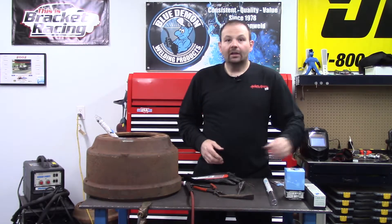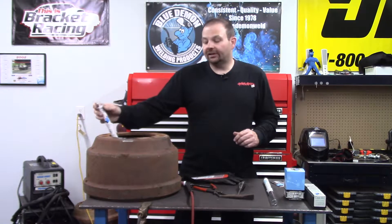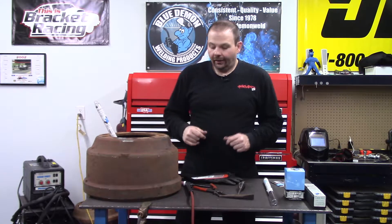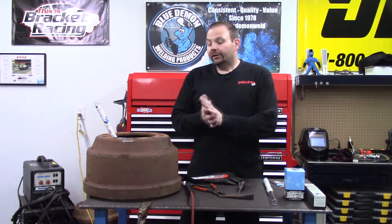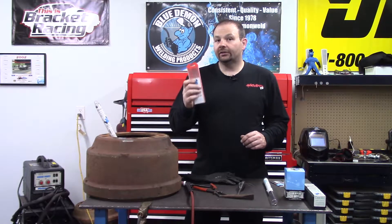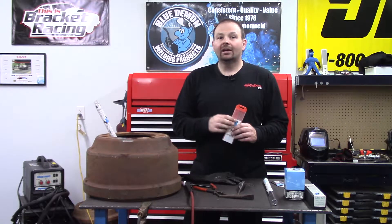With the cold method, this is where BD5000 comes in. You basically weld a little bit and then let it cool — cool enough to where you could put your hand on it and leave your hand there, so really cool. During that process, I learned that 2% thoriated tungsten is definitely the way to go. I tried a couple of different tungstens and they did not work as well — 2% thoriated is by far the best option.